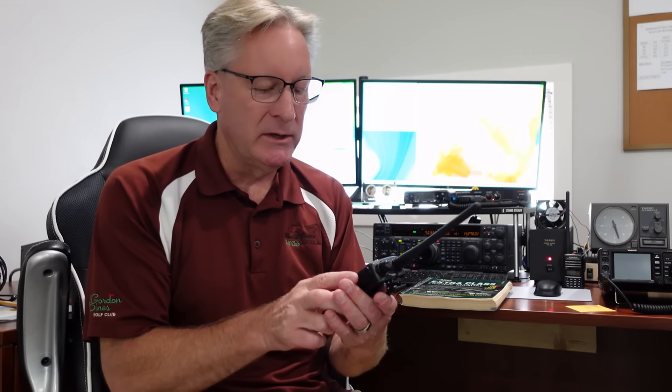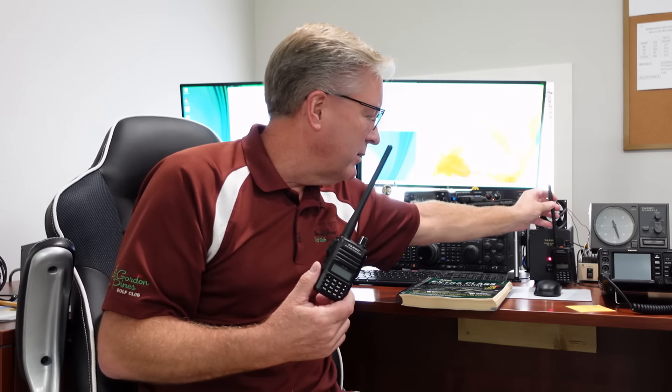The stuff I see is everybody says get a Baofeng — some cheap Chinese radio. Get two of them and you can communicate. Well, that's great. These are VHF and UHF. This one is a dual-band Yaesu — I like Yaesu equipment. It covers 144 and 440 MHz — very high frequency and ultra-high frequency. This is a 5-watt radio. Without using a repeater, simplex, I'll probably be able to communicate about 5 miles with good height. Reliably, maybe a mile or so. If you're down in a valley, you're in a tough situation. Height is a big thing with VHF and UHF.